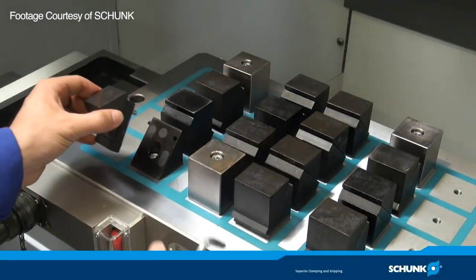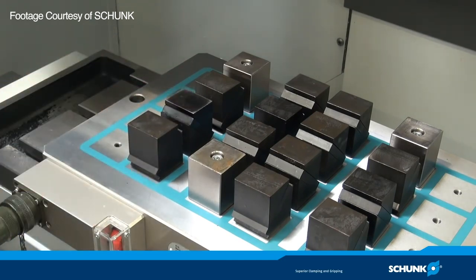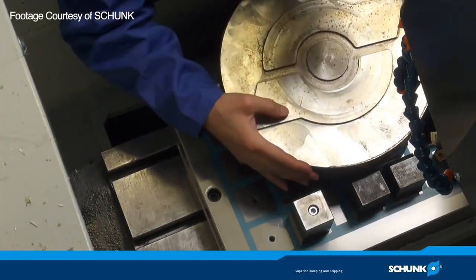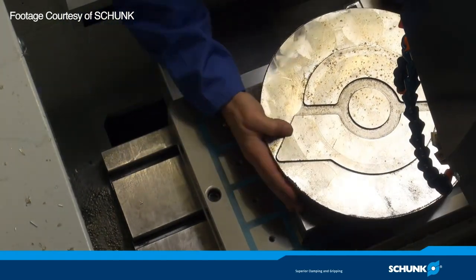Large parts in general are very difficult to hold. The nice thing about steel, for example, when you're machining large steel parts, they're difficult to hold, but one way to do that is with magnets. Aluminum is not magnetic, clearly. So one of the things we've come up with is the idea of clamping it directly and actually thinking about work holding before you're even thinking about the part.